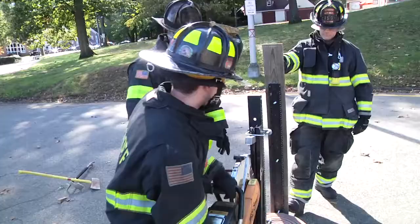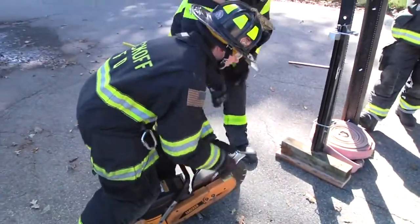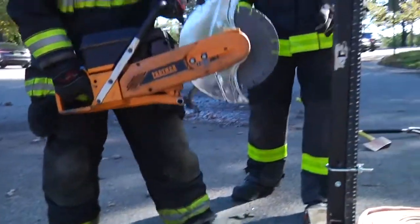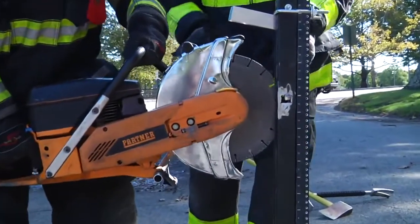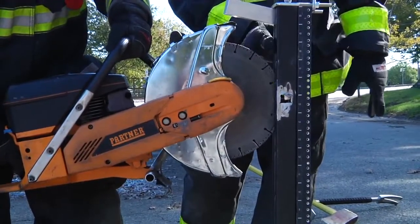So a simple thing to do is Pete's going to kneel down on the saw and with both hands he can just pull back on the blade — right there, that's good. Now he can come in and plunge cut and you'll notice he'll get the depth of the cut with the blade and the guard won't hit the door frame.